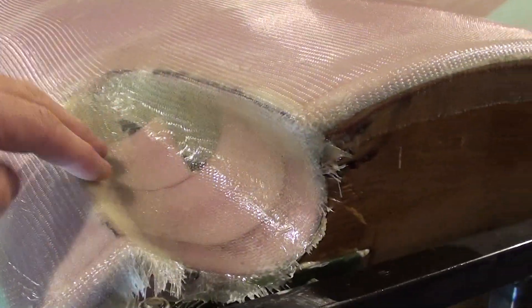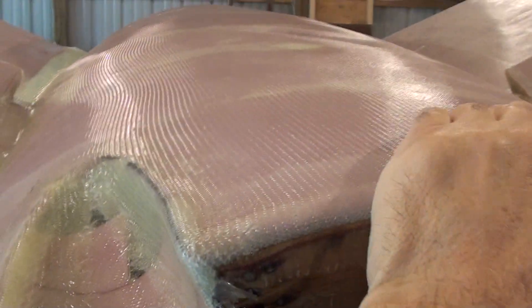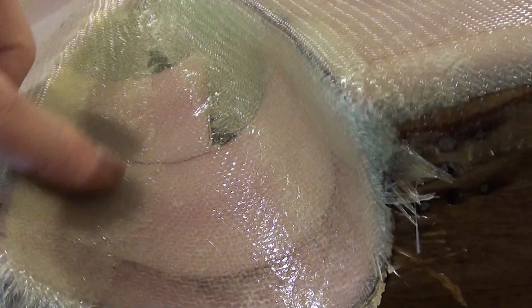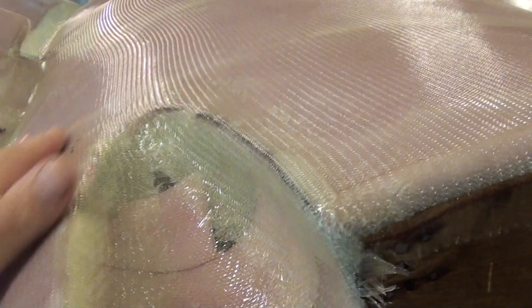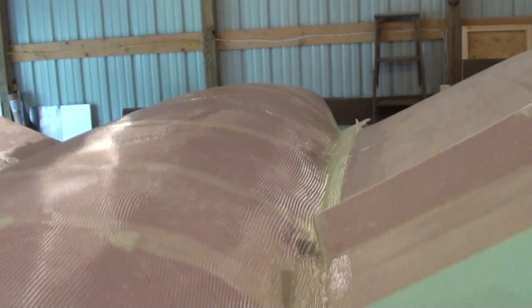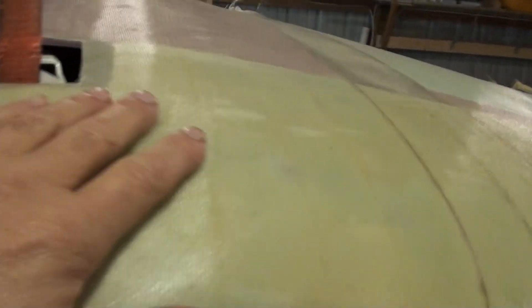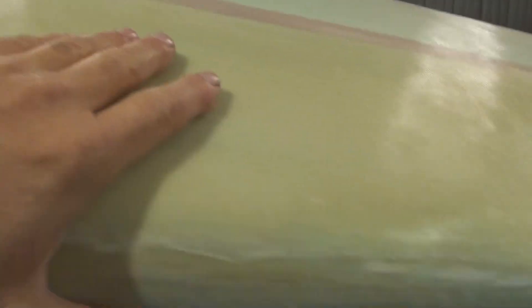The outlets were cut out, glassed first, and yesterday I glassed the whole belly. You can kind of see here where this little V was the cover — I just cut it in half and put it down inside. Then this gets a stainless steel insert to cover that and a little bit around here for the exhaust heat. I've got the belly all done now, all the way back to the tail. Both wings are all glass now, everything's finished off.